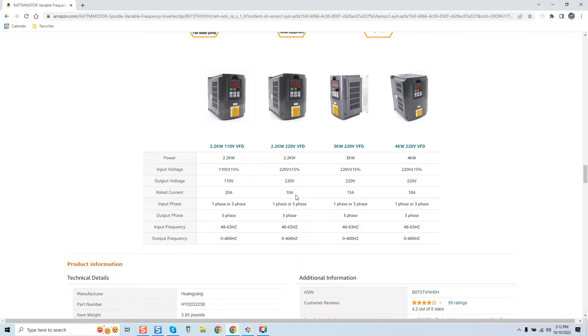We already know his cable is only good for 12 amps. How safe do you feel running that equipment? He's having his VFDs branded in his own name, and he's running 2.2k and 1.5k VFDs — whether 110 or 220. If his VFDs output the same power as an HY, and the rating is the same, it's irrelevant what name is on it. What you see on current is accurate. That means he has incorrectly matched a cable.